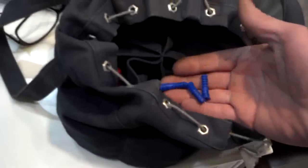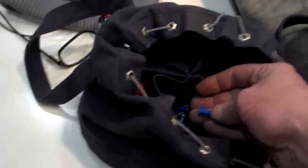Once you dink the tile with the center punch, the drill won't wander — it'll stay in that little nick and make a nice straight hole. You may also want a stud finder, although you can always use your knuckles: listen for the sound — hollow, hollow, hollow — it's a different sound over a stud. You're also going to need a supply of mollies; sometimes the grab bars come with their own, but I always like using my preferred kind.